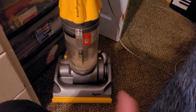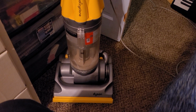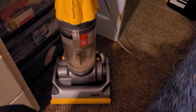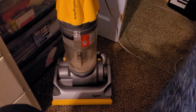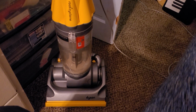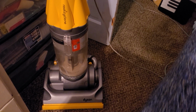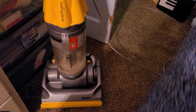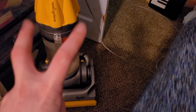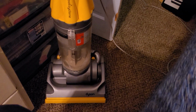Of course, the belt on this is not going to last nearly as long as it would on a clutched unit. But the clutch unit's belts don't really last longer because they're better quality belts, although I think they are. They're not lifetime belts or serpentine belts. They're literally just rubber belts, but they put way too short of belts on them, to the point where they last longer because it's already so tight that it can stretch out more before it gets to an unacceptable level. It's really bizarre the way they do it on the clutch models. This is a lot more straightforward.